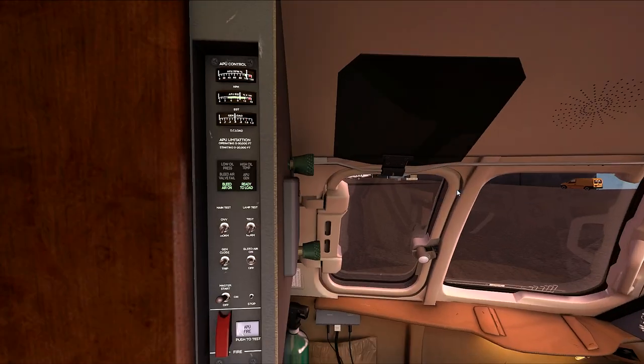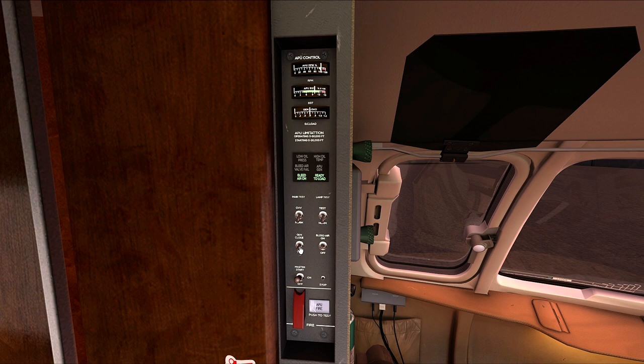But first, let's go back and cut this one off. Normally we would trip the generator to do that, and we'd get rid of the bleed air. So we'll cut that off, and then we can hit the stop button here. I see that it's still up in the start position, so I guess it's not spring loaded. But anyway, we'll put that just to on, and it's going to wind down. Actually, it's not, because there we go. Now it's going to, I think, because I clicked the button there. So the RPMs are coming down, EGT's coming down. Is the gen load? Yep, everything's winding down from there. So that's what we want.